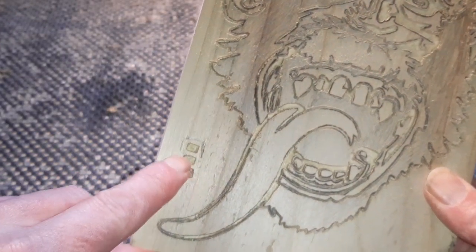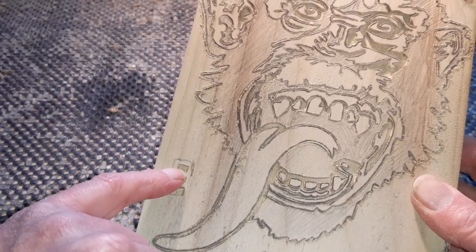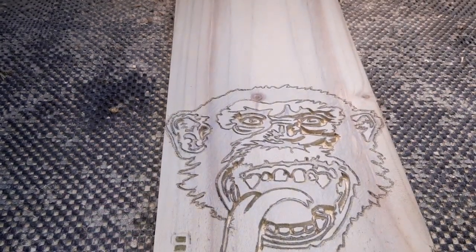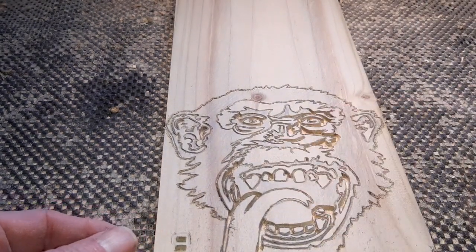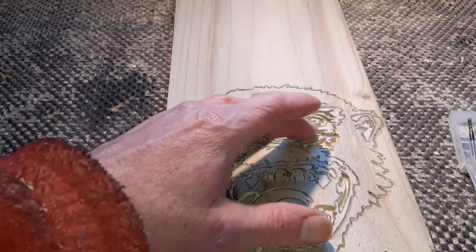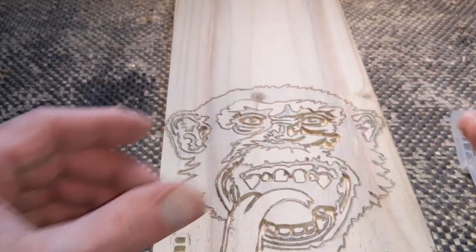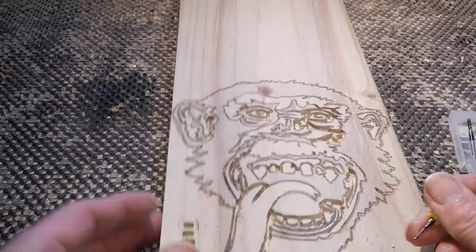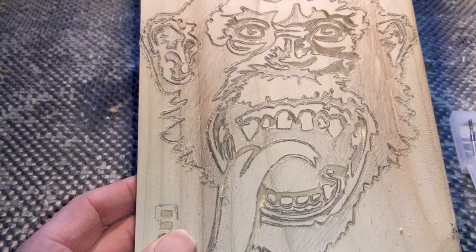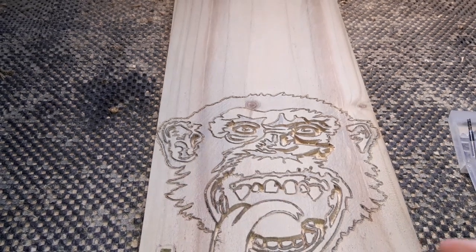And you notice here I did a couple of little test runs on there as well, on a piece of scrap wood to one side, and I went for the third one. So that's the depth we're going to set our end milling bit in. Want a nice small one, remember, these come in packs of 10. They're ideal because they clear out the bottom of the wood, as well as the sides, so they have a little rough base on them. So even though it's not a perfect finish, it'll leave you quite a smooth bottom on there, if you know what I mean. So obviously now we're going to remove all the darker section.